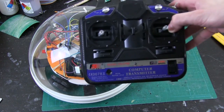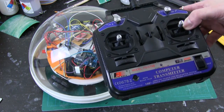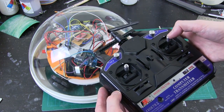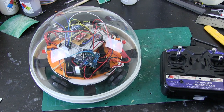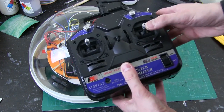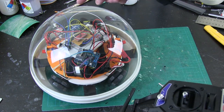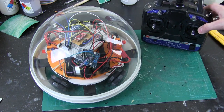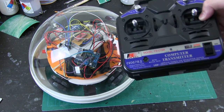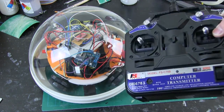So how am I going to make it radio controlled? Probably using one of these — similar to what I used on my R6 Droid — a standard radio control set for cars, boats and planes. This is a six channel version. The challenge is there's only going to be a sweet spot where I can bias the inertial measurement unit numbers to make it drive reliably. The other challenge is that reading the pulse width modulation output actually takes 20 milliseconds in the loop for each channel, of which I need two — that would really throw off the timing for the PID loop and complementary filter. So that's not going to work very well.